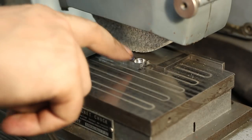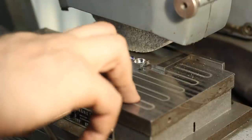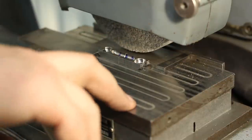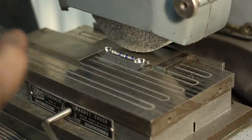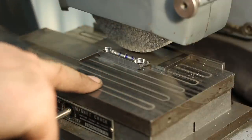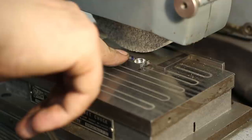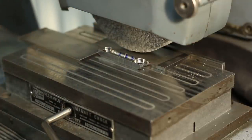Okay, we're over at the surface grinder. It just saw me filing the radius. I didn't dare to mill the radius because the part is a bit unstable on the end, and I didn't want to risk a catch with a 5 mm radius end mill, a round over end mill. Those run relatively harsh. So I filed the radius. And now we take off 0.5 millimeters off the inside of these parts so they can actually clamp on the ball and the round shaft.